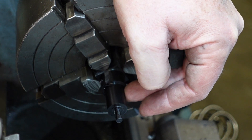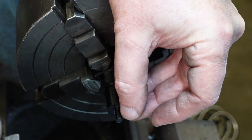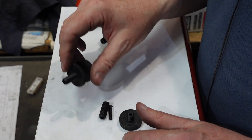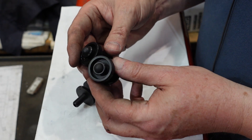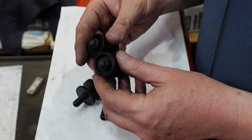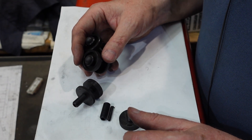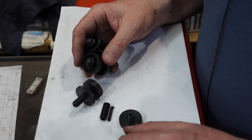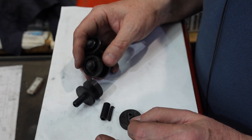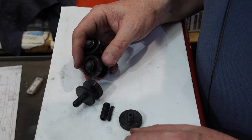Then I can do the rest of the part and basically just put a slit in so it'll click in. From a pile of parts plus the good original one, I've now made two good ones and fitted rubber tips — they should be pretty much ready to go straight onto the machine. One final tip: thermoplastics don't like heat, so if you need to apply coolant, plain water is fine — just keep the temperature down, stop it melting, and use sharp tools. I hope these tips have been useful and we'll see you for the next video.